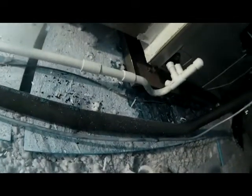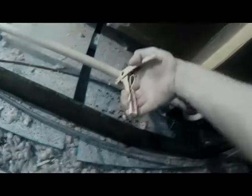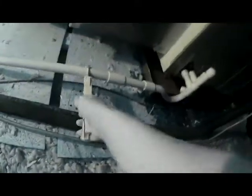More than likely the drain line is stopped up. So let me show you how I clean the drain line. What you need is a 3/4 coupling. We're going to cut the drain here. We're going to blow through this way, and blow through this way, and that'll clear any obstruction we have in the drain. So, let me show you. I'm just going to blow it through with my breath, and that should be enough to clear out anything.